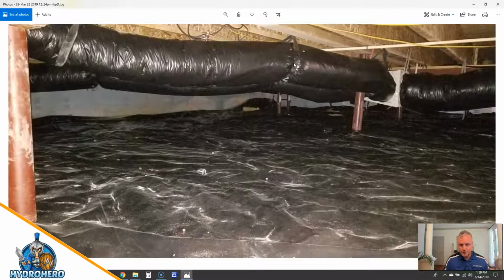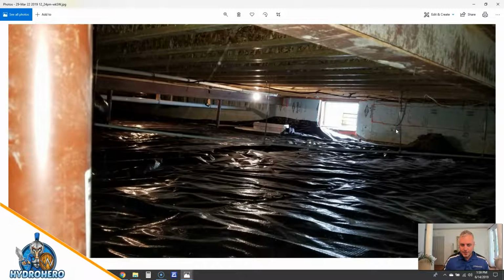Not the greatest HVAC. I'm sure we'll have some HVAC guys that watch this video. The first thing they're going to point out is that the HVAC system is not all that great. They're really not a fan of these flex ducts, it seems, and really want hard sheet metal going everywhere. But that's what happens in the builder base grade homes, at least in our area. They use a lot of flex duct.